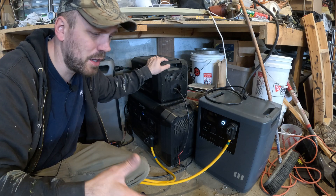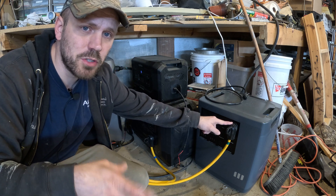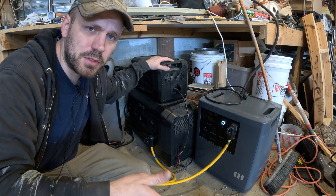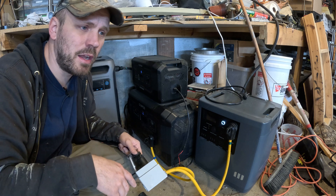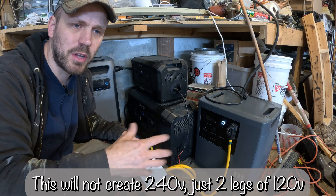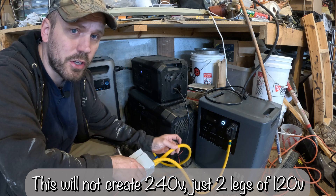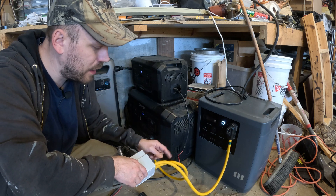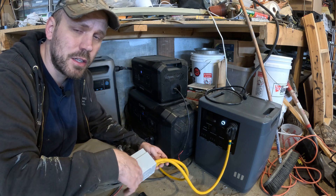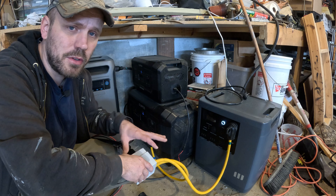This setup is fairly simple to do — anybody could do it. It's pretty straightforward. All the plugs have markings on them that tell you which wire goes where. The plug tells you the green wire goes here, the white wire goes there, and where the black wire goes as well. If you're looking to simplify your life and you have a couple of different power units you want to hook together to extend your run time and not have to switch them out all the time, this is a super easy build. You could just buy an RV cord that already has one end on it, then buy an RV plug and cut the wire in two different spots to give you the cord lengths that you need. I'll put a link in the description for a cord I've used in the past for our camper, as well as links for all the other components used in this build.